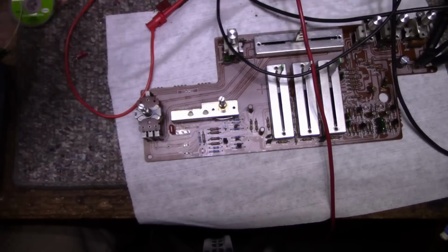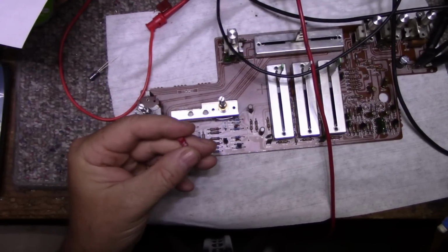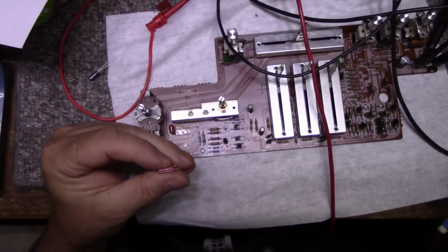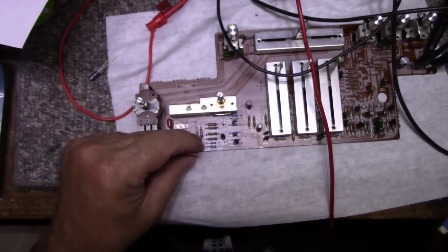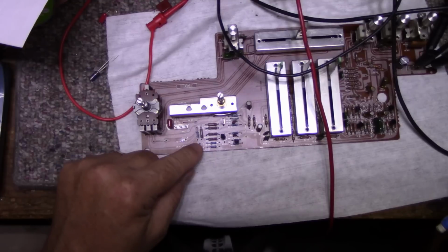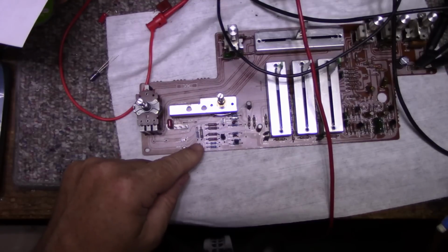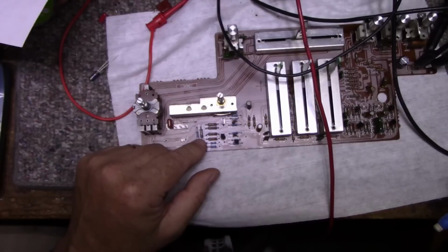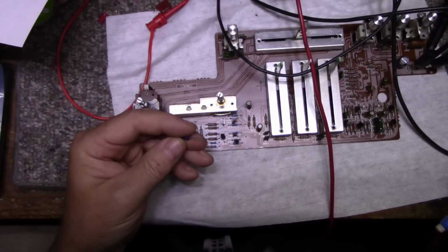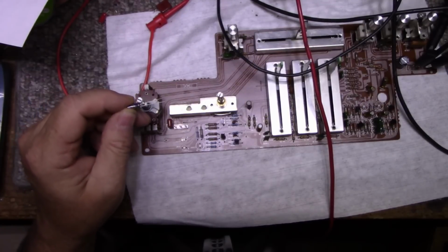So I'm going to replace that with a 50 volt cap now, and I don't know how I missed that. When I pulled that cap out, I can't remember now if it was 25 or 50 volt cap, but I put a 25 in. Maybe I grabbed this by mistake and put it in, and that was the result. It causes a lot of upset in the circuit. Now, spent almost a day and a half trying to troubleshoot this, figure it out. Yeah, it was frustrating, but we'll put this new cap in. This is a 50 volt 22 microfarad, and we'll see if that solves our problem.